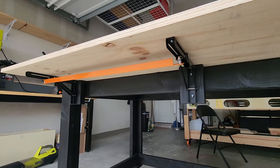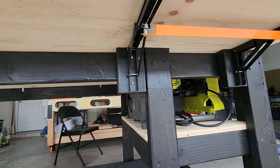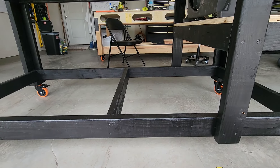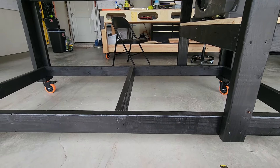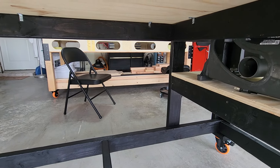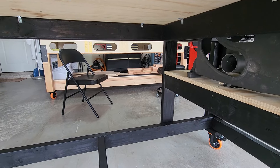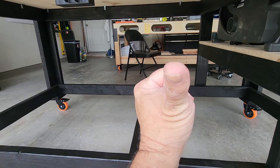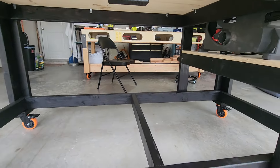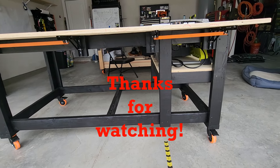I also had to make short blocks for these because otherwise it jams up against the frame and you can't release it to fold it all the way down. You don't have to release it to raise it. I might route out a little channel here for the bar to sit in when folded. I will go ahead and deck the bottom because I put wood across it and it messed up the paint. I did rip a deck for that table with all the spare wood, which is actually why I ended up building this table in the first place — I ripped all that plywood without a table to set the table saw on and it was dangerous. I had a table saw accident back in the day and got five stitches on the thumb. But anyway, I hope you like this build — if you have any questions let me know, and I'll see you in the next one.